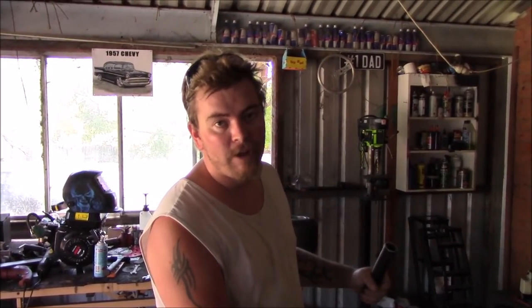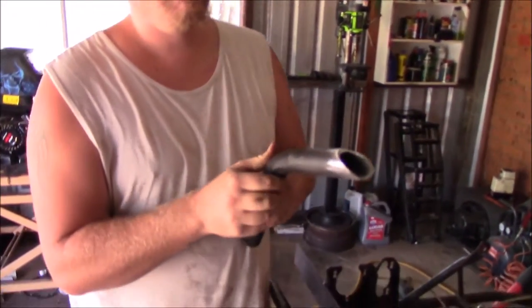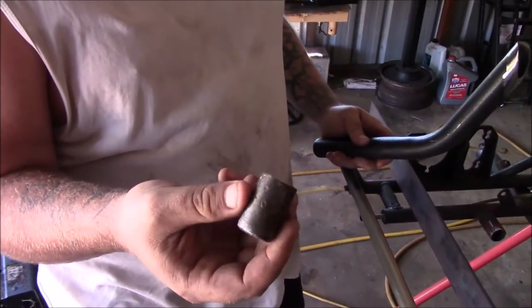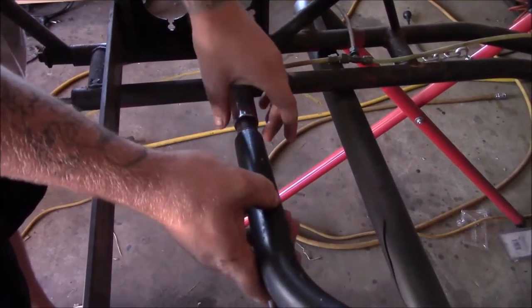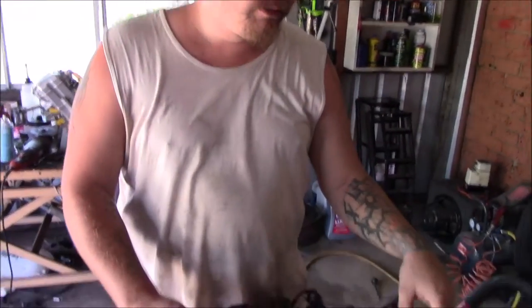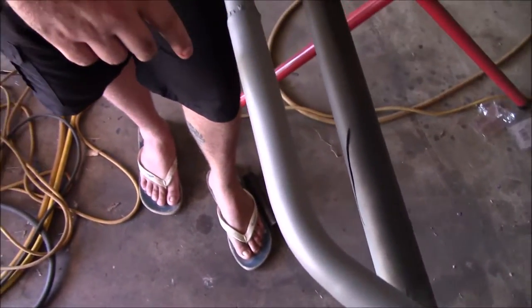We've cut the back half of the frame out roughly. We've got our bent bit of pipe here — I've cut it to the angle it needs to be and notched it so it fits the contour of the frame. We've got a bit of one-inch axle steel to use as a plug between the two pipes so when I weld it up I can leave a gap for a much stronger weld. The pipe is now in, welded up, painted so the welds don't rust, and cleaned up to remove any welding slag.